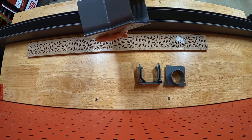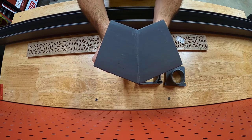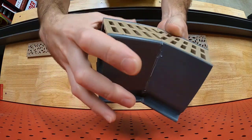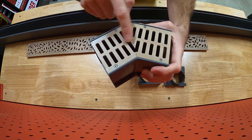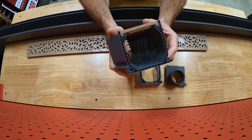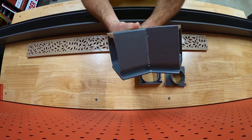Let me talk more about the 45-degree angle piece — I assumed it was one-piece molded construction, but really what they've done is cut some of their channel and glued two pieces together to make the 45-degree angle. It looks like it's just PVC cement. They cut some standard channel grate to meet and installed it with screws. If I'd known this before ordering, I may have just tried to make my own — that would allow a custom angle instead of being restricted to just 45 or 90 degrees.